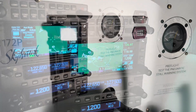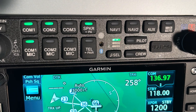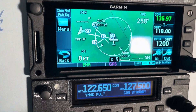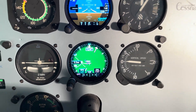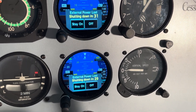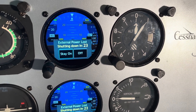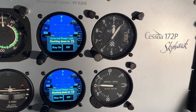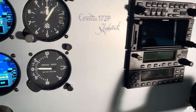If I turn it on — there we go, we've got some lights. The option to pair your telephone. The option to charge your telephone. I wish this was smell-o-vision because you can smell how new all that nice new plastic-y smell is. After we've turned the avionics and battery master off, the two GI275s have their own backup battery, so we could let it count down and turn it off, or if it was in flight and we had an electrical failure, we'd tell it to stay on — that gives it another hour and a half battery. Lots of redundancy built into the venerable old 172 now.